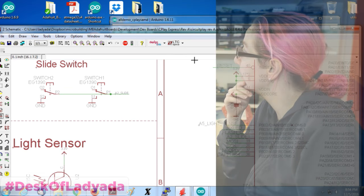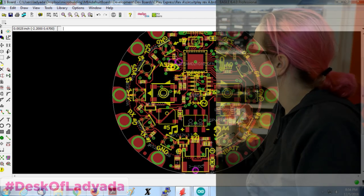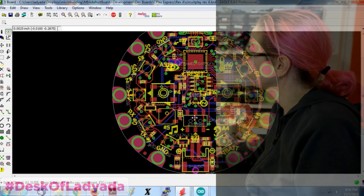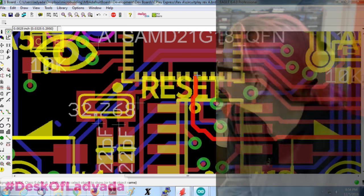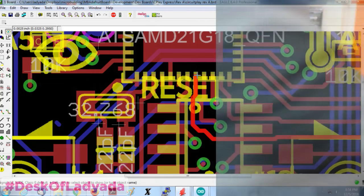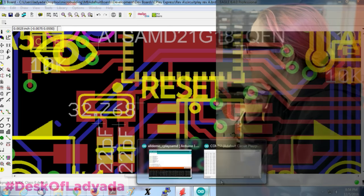Why would it be? Maybe I got the wrong pin name. Maybe it's not A2. Sometimes I change things around. So let's see where this goes. Oh, you know, I think that pin is not soldered. Fifth pin? Yeah, fifth pin. Okay, I'm gonna go quickly and turn on the iron and then solder this after a little bit. I can skip ahead to the next section. Okay, so that pin just happened to be disconnected.